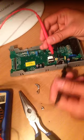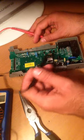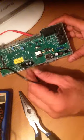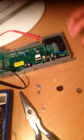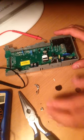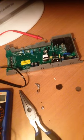If you have a multimeter, check the fuse for continuity to determine if it's good or bad. If you have continuity, the fuse is fine and there might be something going on with the control board or the relays. Hopefully you guys liked this video — I will post more videos in the future. Thanks so much for watching, and thank you for all your comments, likes, and shares.